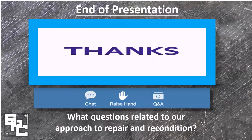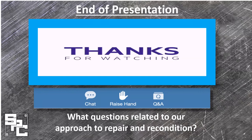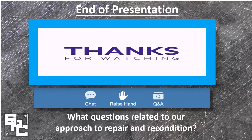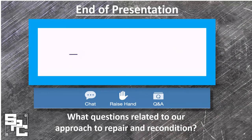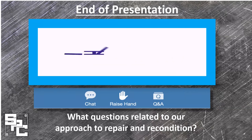We've come to the end of this presentation. It's time for Q&A. One question: is testing before and after the repair, recondition, or replacement always recommended? Testing is not always required before service. After service is generally required — we try to do startup and performance testing. If the system is good at collecting head, flow, temperature, and amps, we can draw that report and see the trends. When we go back out, that's really one of our final quality measures — when we start the pump up, is it running the way we want? Do we have those low vibrations, are we meeting those heads and flows?